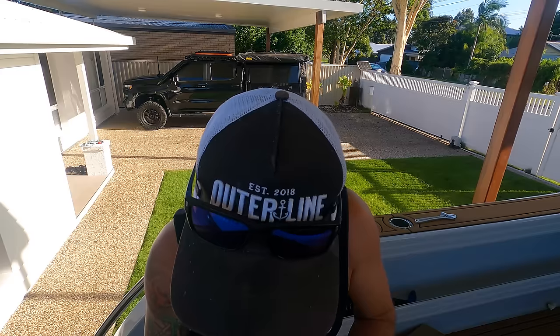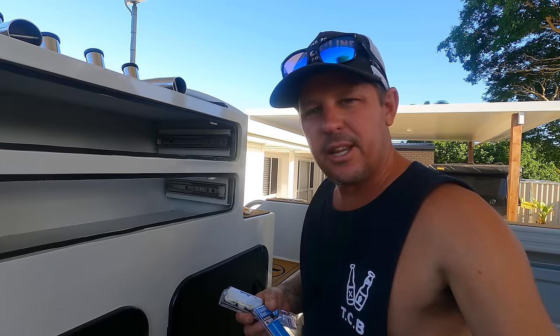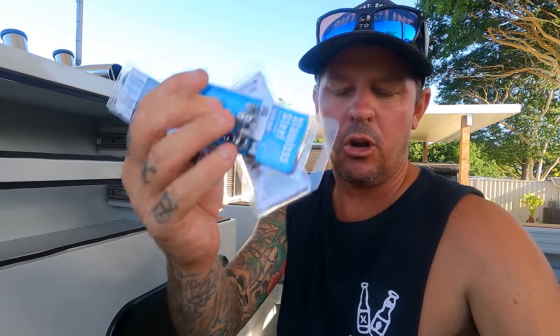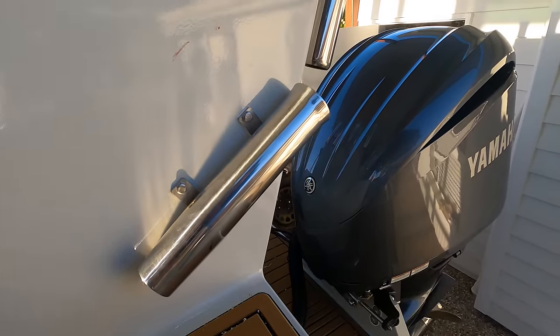The old Tef-Gel. On the end of the bolts on the inside, what I'm doing is I'm putting a nylon washer, then a stainless washer, then I'm going to put a nyloc nut on it, and thread seal it. So that's about every precaution I can take for getting the metals not touching each other. And hopefully two, three, four years down the track, it's still like this. All right, it's taken a while, but it's coming together. I'll show you it at the end.